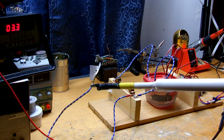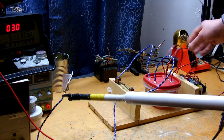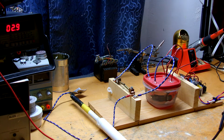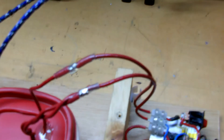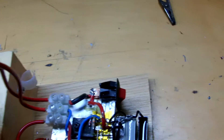Looks like we've got some smoke over here from these primary windings — they definitely can't handle too much of that. I'll take the camera off the tripod and show you the driver. These leads right here get quite tacky after a little bit of that, starting to melt. They're only 16 gauge conductor, so they're definitely not meant for what I just did to the poor things.